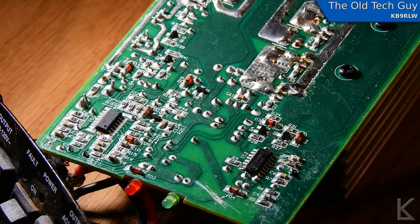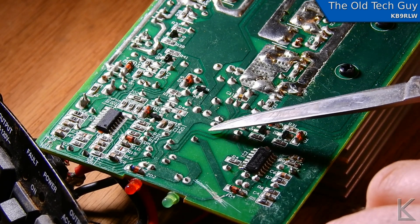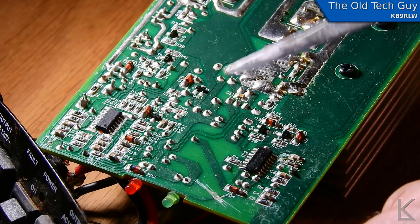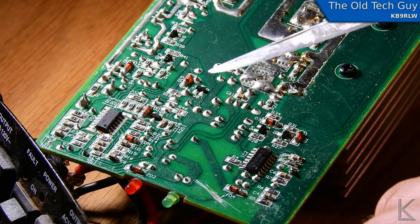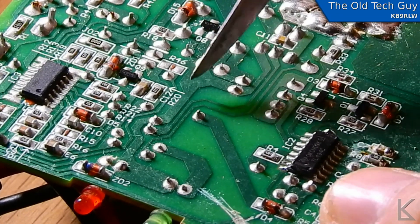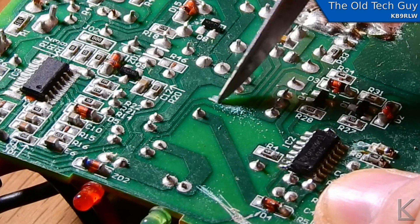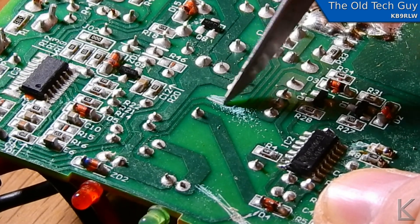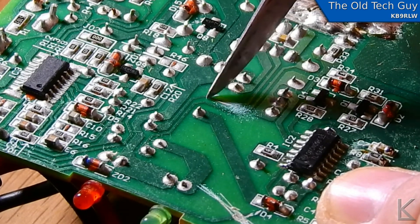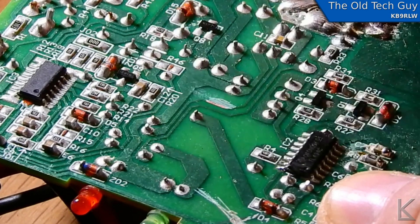The board is coated — there's solder mask on it — and we need to get to the copper on that trace. I have a very sharp tip blade. You could use an X-Acto knife; I don't have one handy. What you need to do is very, very carefully scrape across the top of the trace along the line of the trace until you start to see bare copper. You don't want to push too hard. Take your time, blow the dust away. As you can see, we're starting to see some copper here. We'll very gently scrape that away to bare the copper, like so.